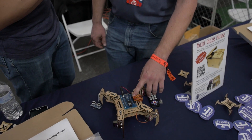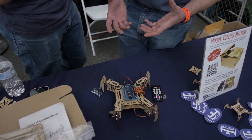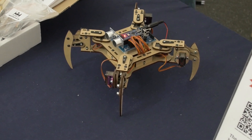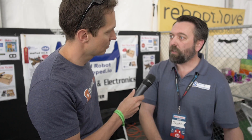So what expansion do you have? You're showing what it can do out of the box, but you can add things to it, correct? Right. You can add the Wi-Fi module and Bluetooth module so you can communicate with a cell phone. We also have an I2C port so you can daisy chain up to 255 devices on that port. Say you wanted to add four light sensors, one on each side of the robot — you could measure the light values on each sensor and make it either walk toward the light or walk away from light.